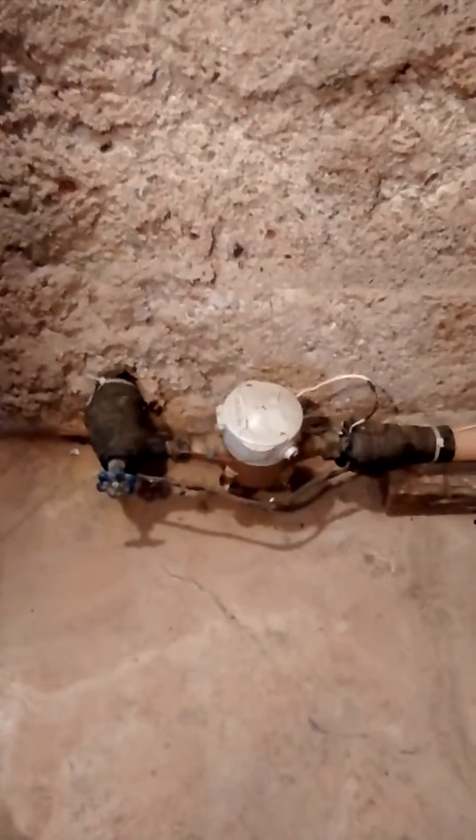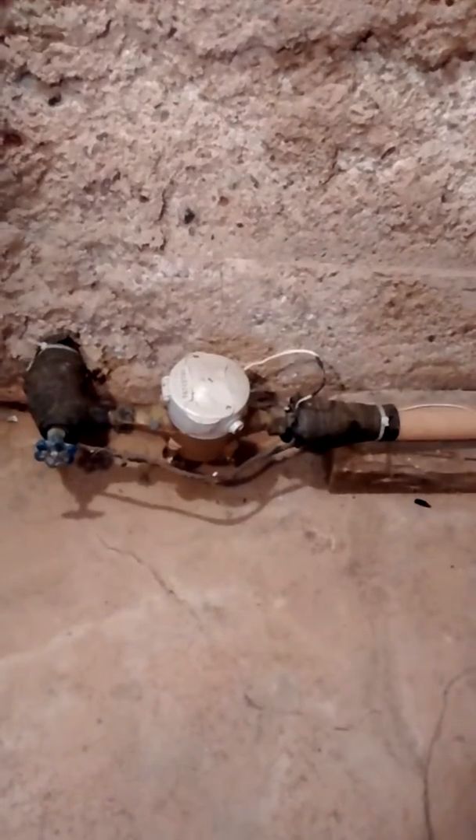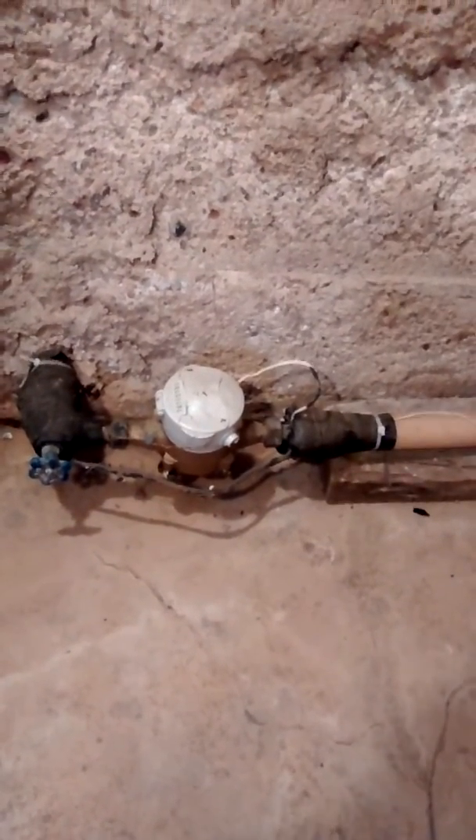To ground the main box, this is the number four wire — one goes to the cold water pipe. I have to jump the cold water meter there, but the clamps are underneath the rubber taping to keep it from freezing. A piece of number four wire goes to the grounding rod which is outside.